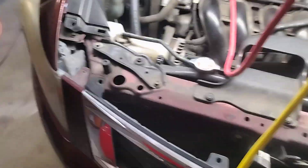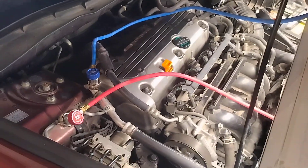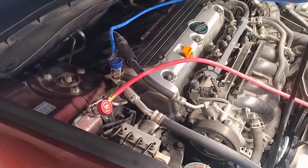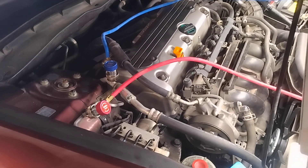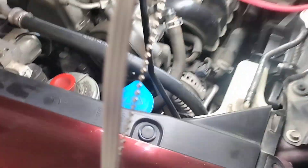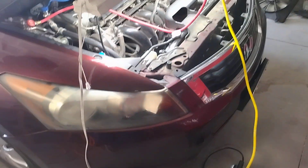Once you've finished everything — you've got all the O-rings replaced, everything's reconnected — it's time to get out your gauges and pull a vacuum on the system. What a vacuum does is it cleans the whole system out, removes any impurities, and ensures that there's no leaks. A vacuum also assists with the movement of Freon through the system. If you don't have a good vacuum pulled, you won't be able to charge it with Freon. When the vacuum is being pulled, it also pulls all of the oil through the system that you introduced into the AC compressor. Bottom line is, without a good vacuum pull, you won't get a good charge, and you could cause damage to the AC system.